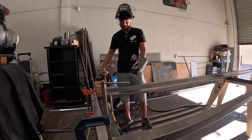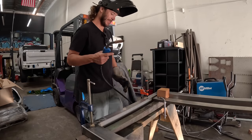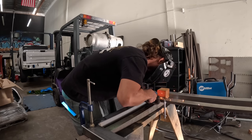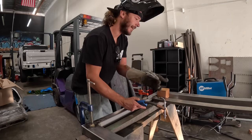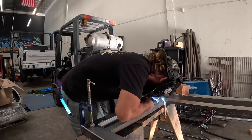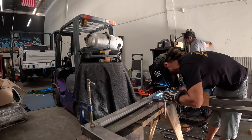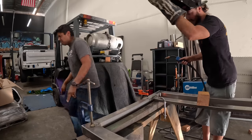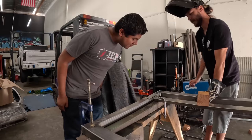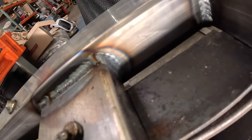The crappy thing about this being 20 feet long is I've got to constantly unclamp, move the welder to the other side, and reclamp. We welded the other side fully, so we're just going to fully weld this side and hope for the best. It got a little hot at one point — not too bad of a weld though. This is 16-gauge on the cross section, so they're a little thinner and we're welding on an edge with a tiny gap. My helper came over inspecting the welds — we're looking all right.